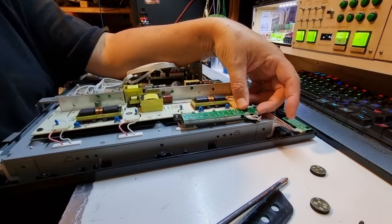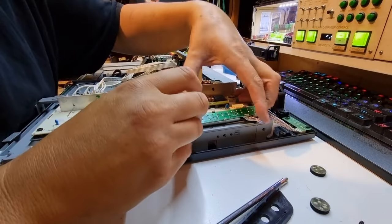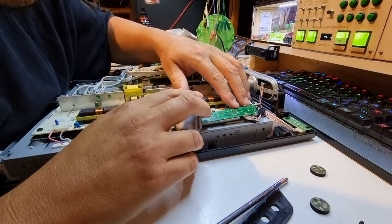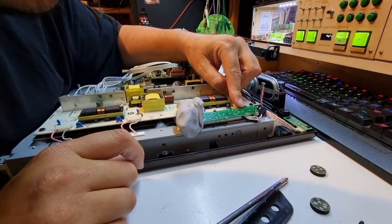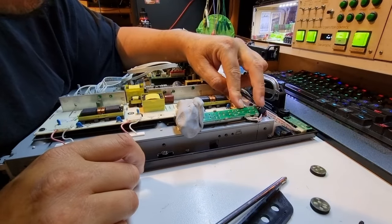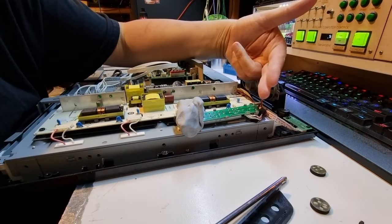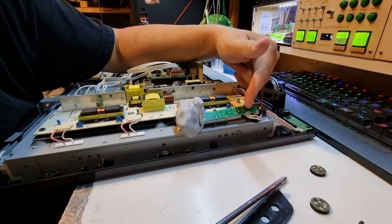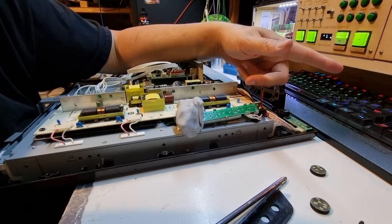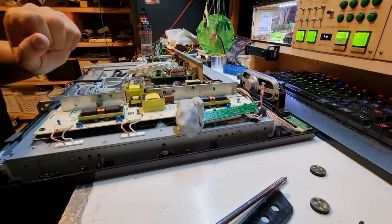What I'm going to do is get some blue tack and stick it down. I'm going to grab a tremendous blob of blue tack here, stick that down, and I want to get two wires across that, and there should be ample room to hang it out the back there, which would be nice. So the idea is by getting a piece of wire or a piece of figure eight wire across that, I can hook it to a relay and it simulates pressing the button in a nice electrically isolated way. And considering this is the mains board here, I like electrically isolated.